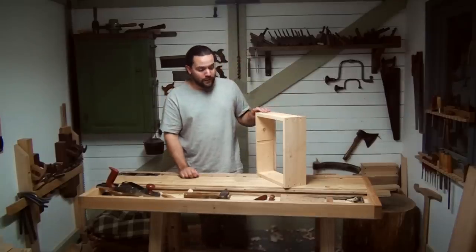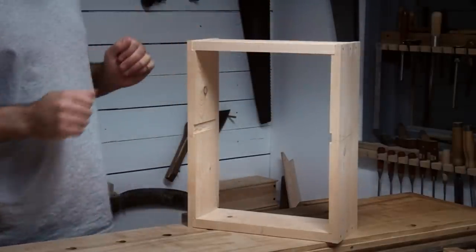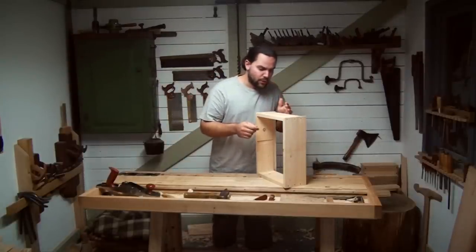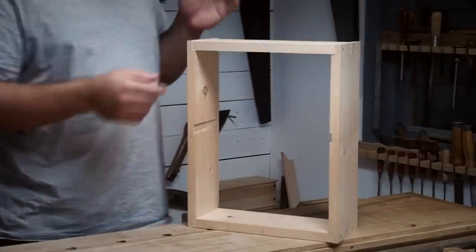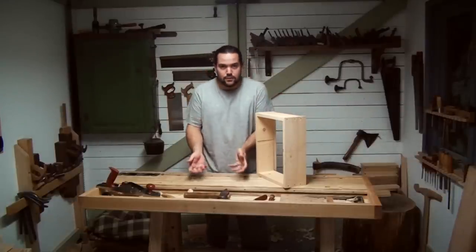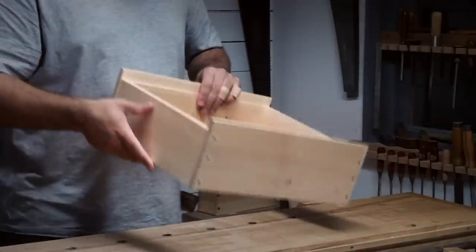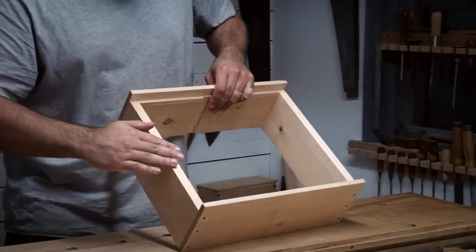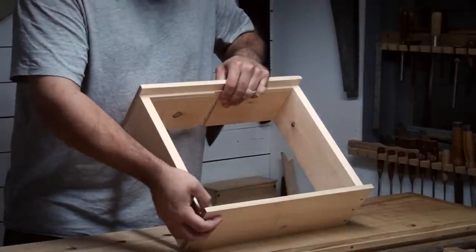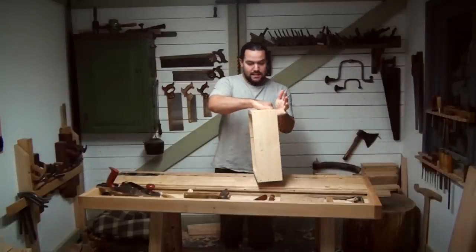You may recall in part one that I mentioned not all of the pieces for the carcass may be parallel. We could have planed them parallel, but it's a lot quicker to roughly plane to the line. What we did do is make a reference face — whenever we shot a component to length we placed that reference face against the fence of the shooting board. That keeps everything true and square to one face. When we put this together all the reference faces went to the back, so the rebate meets the top and bottom flush, and there's no twist in it whatsoever. So the back is spot on.